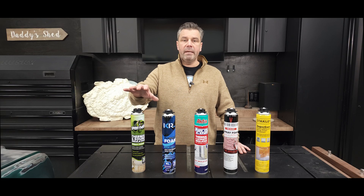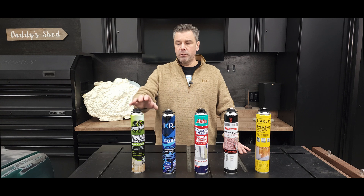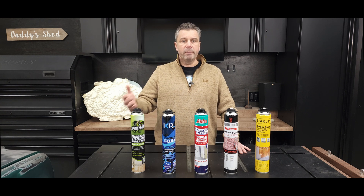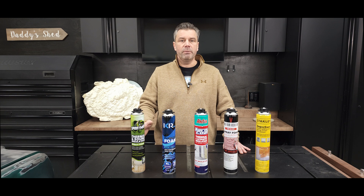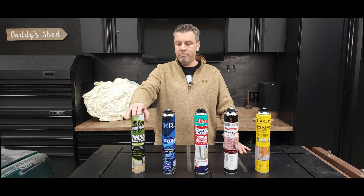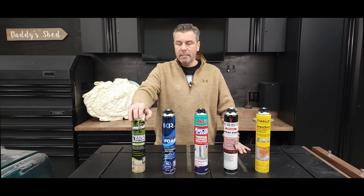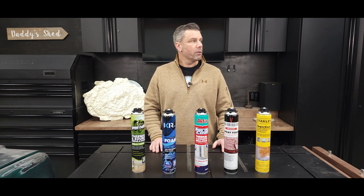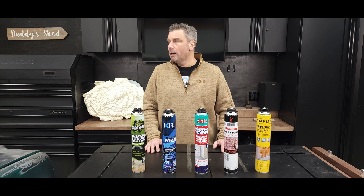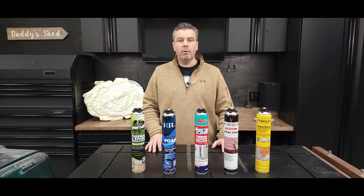Keep in mind that none of these are really meant to be fireproof in any way — it is the inexpensive way to insulate something. If you do need fire retardancy, you could coat these with something like DC-315, which is a fire retardant coating that you paint on. It's a pretty expensive product, but if you have a situation with a lot of sparks flying, a welder, or something that requires it, that might be the best way to go. We do plan on running a fire test between open cell foam and closed cell foam in the future, with and without paint to see the difference. It might take us a month due to two feet of snow and eight-degree weather outside. If there are things you want to see answered in that video, put them in the comments and we'll do our best to get to that. Thanks for watching.